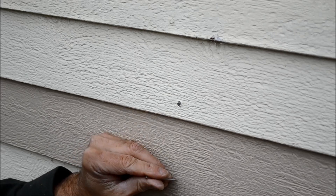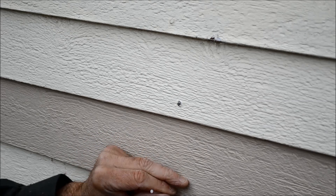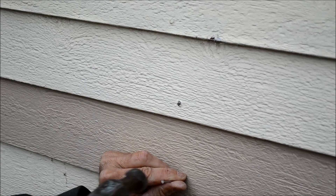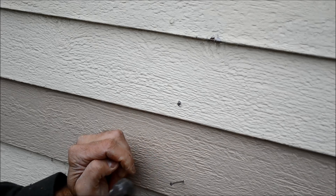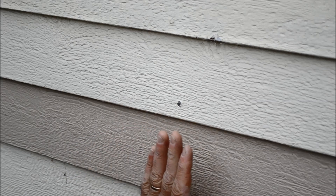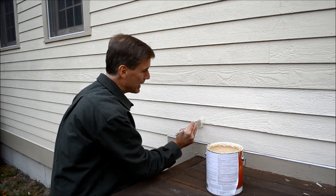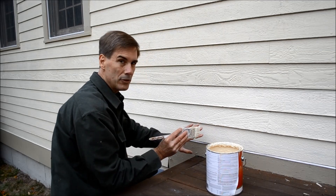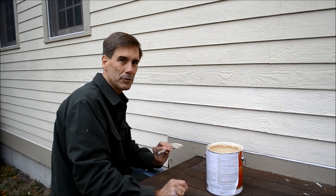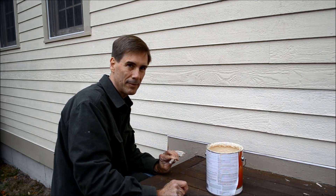I'll then also place a single nail about three-quarters of an inch from the base of the new clapboard, right underneath the nailing of the upper clapboard. I'm going to repeat this process along the length of the clapboard. So to wrap up this project, I'm just putting two coats of paint on the new clapboard as well as a couple of the boards above it. And that's all there is to replacing a piece of clapboard siding. If you have other home improvement questions, make sure to visit HomeEditionPlus.com today.